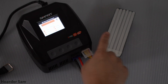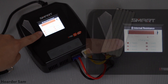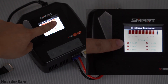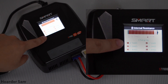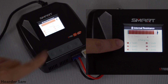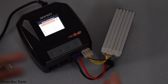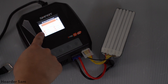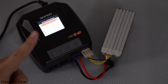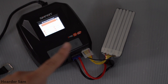Alright, I'm charging up this LiPo — check out the internal resistances. It's 2.1 milliohms for this cell, 2, 1, 2, 2, 1 across the cells. That's absolutely crazy — this thing has crazy low internal resistance. The lower the resistance, the better, which means the more current it can put out. This LiPo has between 1 and 2 milliohms of resistance per cell. That is really, really good. The entire battery is 12 milliohms total — this thing is going to be a punchy battery.